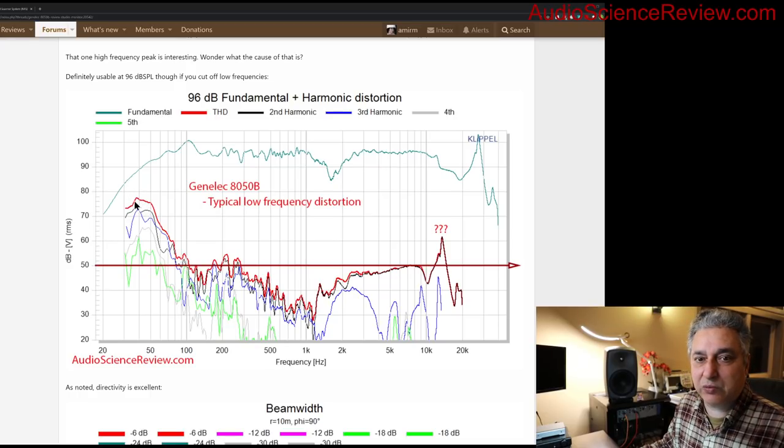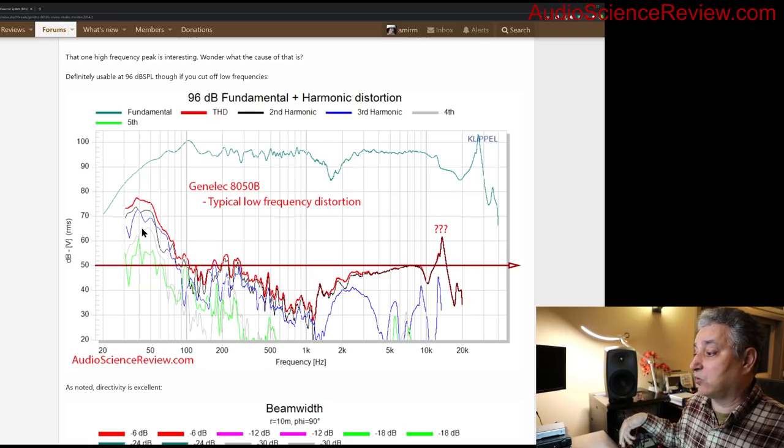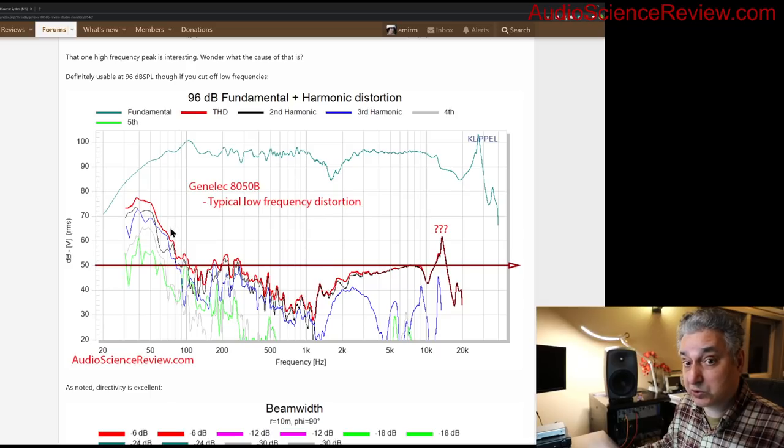I've made an arbitrary decision to use 50 dB as the threshold for a fantastic speaker — don't ask me to justify it, it just is. Great speakers come very close. Above 100 Hz this speaker essentially has no distortion; it's extremely good. Distortion comes in at low bass and there's no way around it except with much larger speakers and more drivers that don't have to move as much.